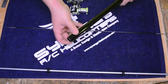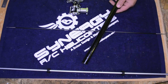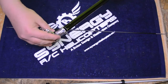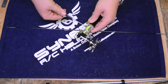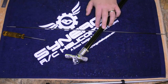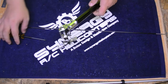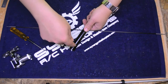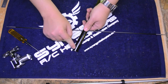Boom is cut. Off camera, I went ahead and drilled the hole for the tail box pin. What I did was slide the tail box on all the way, then take my driver and cinch up the clamp so that's how it would be installed. This is a 3 millimeter screw that goes through that hole. So I took a 2 millimeter drill bit and ran it through there with the case on — that way it wasn't going to damage the threads in the aluminum. Drilled the pilot hole, then took my two-and-a-half mil and reamed it a little bit larger.